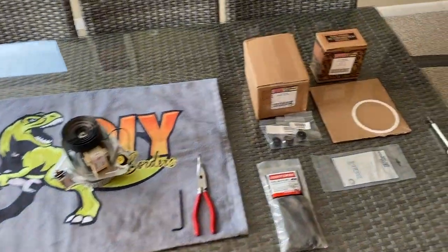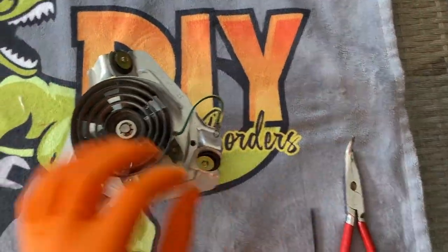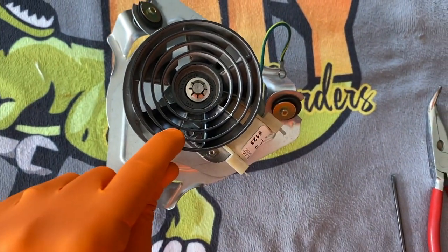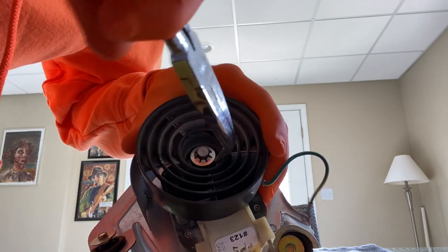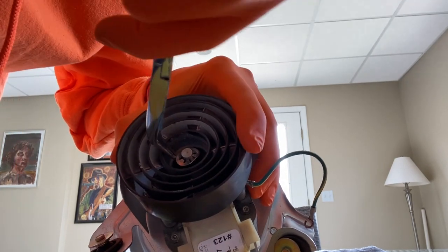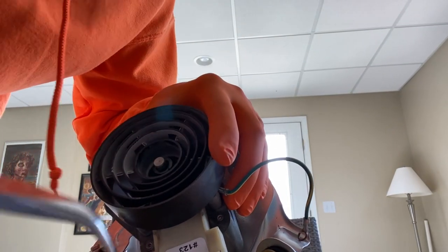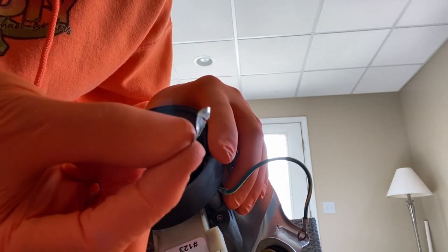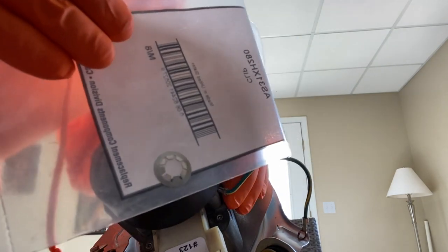At the table now, we've got a bunch of new parts. The first thing we're going to do is grab our pliers and remove the little locking clip that secures the fan to the motor. Some people use a flathead screwdriver, others use pliers. Carefully remove this locking clip without harming the fan. We damaged ours, but we bought a brand new one for $1.99.